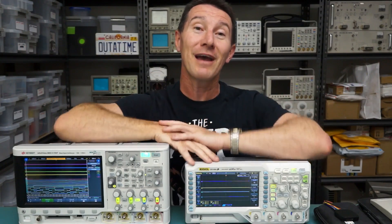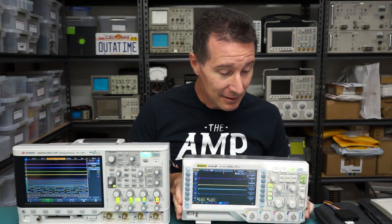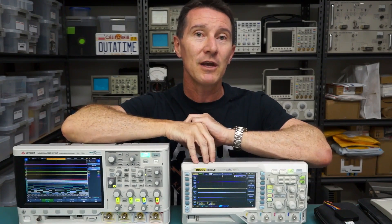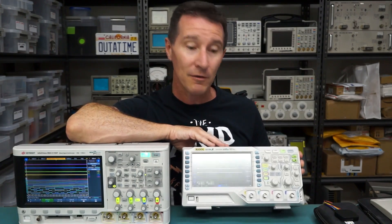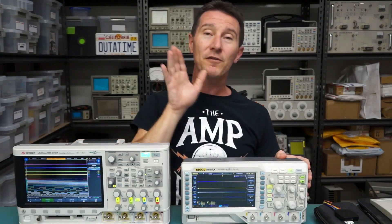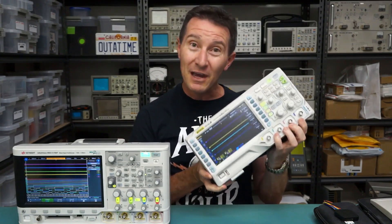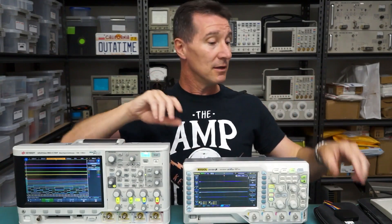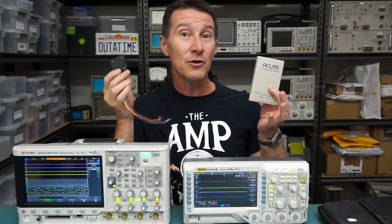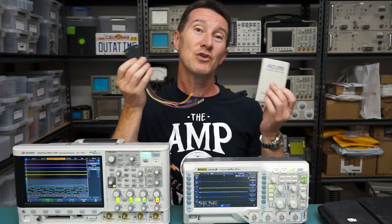What do I recommend after all that? Well, I recommend that you don't spend the extra money on the MSO upgrade for this, unless you have a specific need or money's not much of an object. If you're buying one of these, money's probably a bit of a concern. You're better off getting the base scope, getting the software option for serial decode — you've already got a fantastic four-channel serial debugging logic analyzer built in — and just get one of these external logic analyzers if and when you need it: if you need a lot more memory, infinite memory, sample compression, or state analysis.